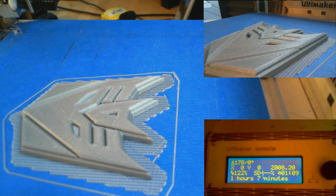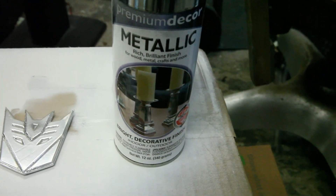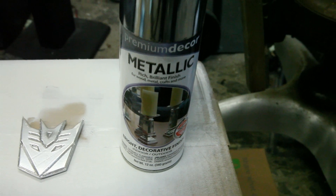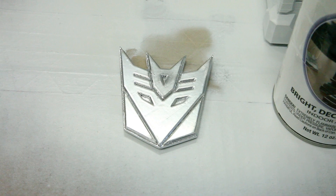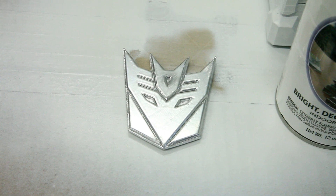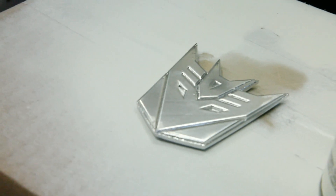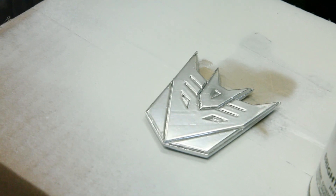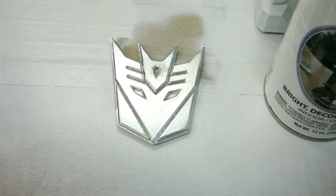Here's what it looks like after I painted it. I used some metallic paint — Premium Decor — it works pretty good. You just have to keep your hands off it after you paint; I touched it and you can see a couple spots where it went dull from touching it too early. You've got to leave it sit for days. It also really needs to be polished once the paint sets — I'm going to use some rubbing compound because you can see marks from the printer lines. If you sanded and primed them first before painting, they'd be flawless.